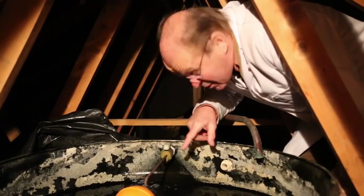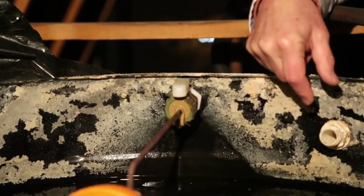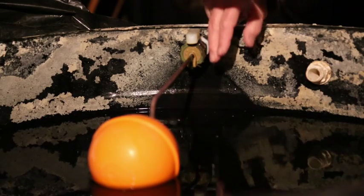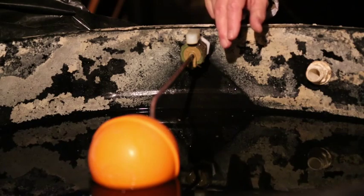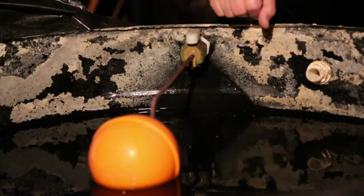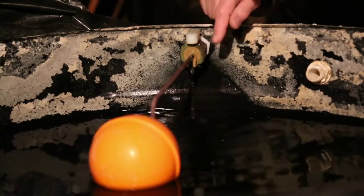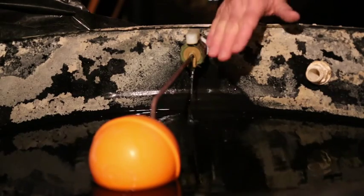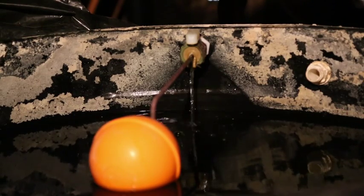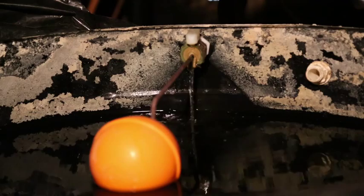Now if you come in and look closely, you can see the drip coming out of the ball valve. That drip will go on and on for hours. Now the ball valve is virtually stopped, and we're going to flush the toilet and see what happens. The toilet has now been flushed downstairs, so the tank will slowly start to drop and the ball valve will open slightly, and here's the little trickle that's coming through from the ball valve. This will take a minute to happen, so we'll speed the clock up a little bit so you don't have to sit around for the next ten minutes.